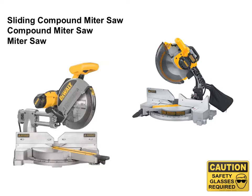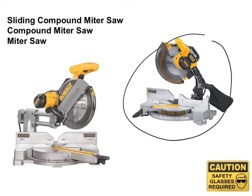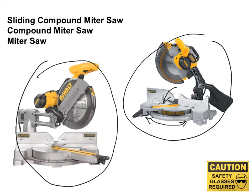This slide shows you a couple different types of miter saws to choose from. First, we have a regular miter saw where the table can rock back and forth and the saw can go up and down. Next to it, we have the sliding compound miter saw, which is a little bit more detailed. It has a slider which allows for a longer depth of cut, a bevel for making angles, and a handle you can turn to rotate the angle of the saw and make compound bevels.